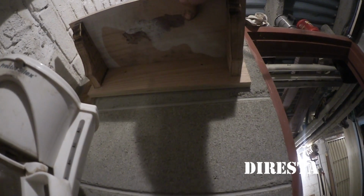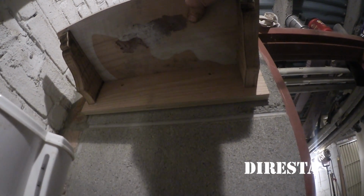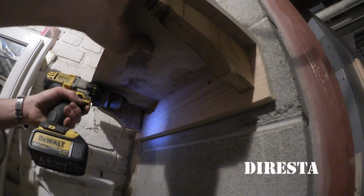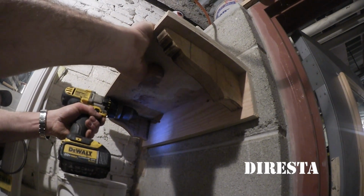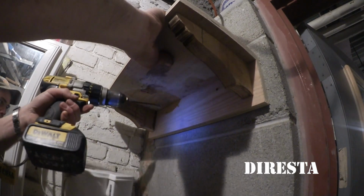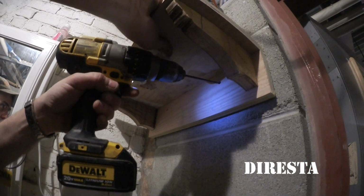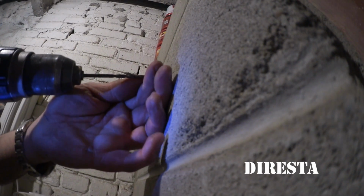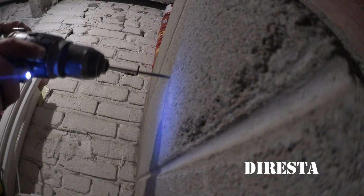All right, we're going to put this in the bathroom. Let's just assume it's level and we know where we want it. I put the drill in and I give it a couple of clicks just to give me some marks on the wall. And now I know where to make my holes. These bricks are hollow, so I was able to go all the way through it.